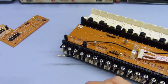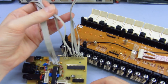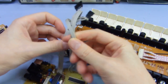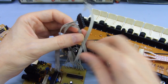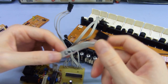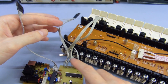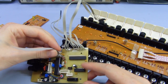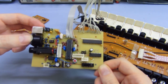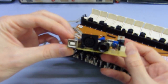It basically drives from this 74HC154 — I think that's some kind of binary-controlled decoder — which scans through the 16 outputs across two sets of plugs along the different sections of the key matrix. These are kind of like row drivers; these are column drivers. These are read by the Atmega328 down here, which scans out with this counter chip here that drives the 74HC154, which then drives all these. And this 7404 drives the output to the MIDI port, which is output only — there's no input functionality, it's not really necessary.